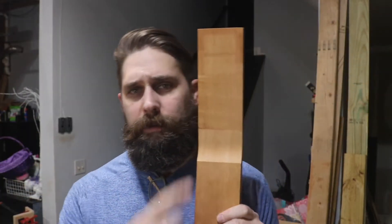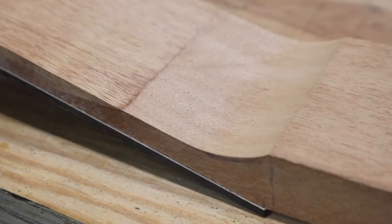The volute is a little bit thicker right here so I'll be shaping that. What you can see is it reveals the joint where the scarf joint came in on the back, and I don't like the way it looks — there's some discoloration on this side. So I got onto LMI and ordered some Indian rosewood veneer. In the video Robby uses a darker burl veneer, but I couldn't find any without spending more, so for about $12 I got Indian rosewood veneer to cover that joint and help strengthen it. Until that comes in, I can work on the heel.